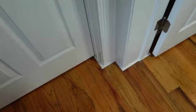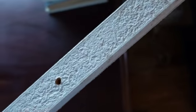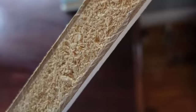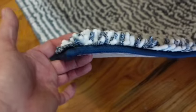So that's the way all that looks. I had to take this door off, and I'll tell you why. It's because of that. That thing right there is thick. I know this is a tile thing, but I can talk about whatever I want to. I cut the bottom of that door off. Before you do that, drill holes and make sure you've got enough wood in there to do that with. Because if you don't, your door ends up destroyed. So I drilled in enough, and I made it so this thing is super comfortable. It's so wonderful to walk on. And see, now that passes over that.